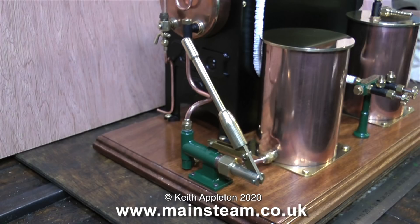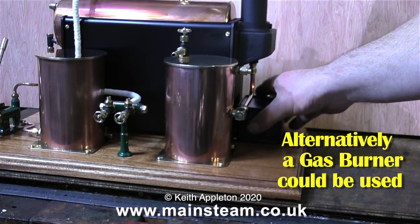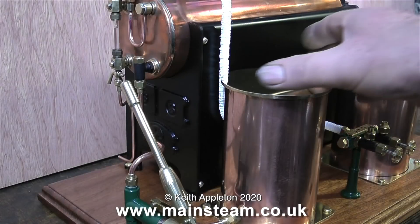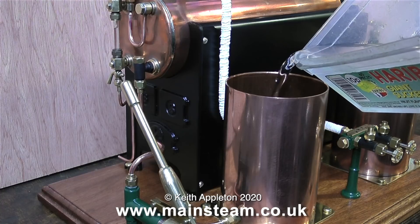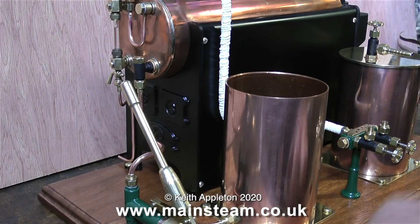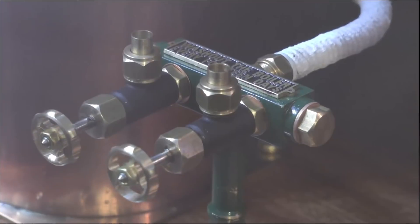When filling a boiler, keep your eye on the gauge glass — you do not want to overfill it. Stop pouring water once the water is three-quarters of the way up the gauge glass, and only then introduce some heat underneath the boiler. The Stewart 500 range uses a spirit burner, but alternatively a gas burner could be used. These old spirit burners are very good — they provide a lot of heat and steam is raised quickly. While the burner is working, fill the water reservoir tank to the top using ordinary tap water. The reservoir tank will frequently need topping up as you pump water from it into the boiler. With the twin spirit burner underneath, steam is raised in about 10 minutes.